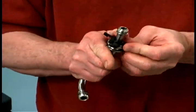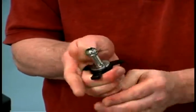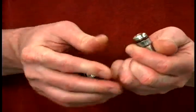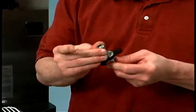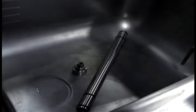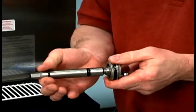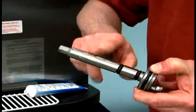To assemble the feed tube assembly, slide the valve O-ring into the groove of the feed tube. Install the two red O-rings on each end of the mix feed tube and generously apply lubricant. For the C707, place the feed tube and orifice into the bottom of the hopper. For the C706, slide the large black O-ring and the two smaller black O-rings into the grooves on the shaft and thoroughly lubricate the O-rings and the shaft.